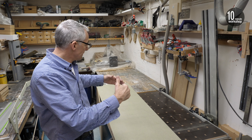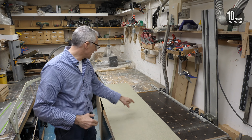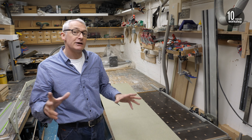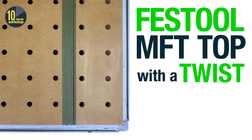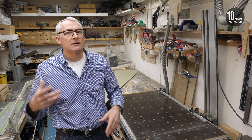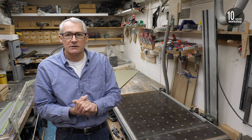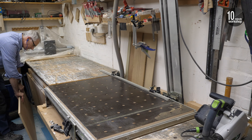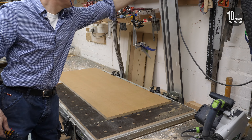I've got an 800 and a 1400 roughly for the long angle pieces. Once those are cut and the angles confirmed, I can get the shelves done as well as that little top piece. And if you've seen the MFT replacement top video, one of the reasons I made a wide sacrificial strip was so I could do bevel cuts on the MFT — that's what I'll be using here, because it means you're not having to clamp the rail or anything like that. The angle's all set, so let's crack on, then offer them up and make sure it's a nice tight fit before carrying on.